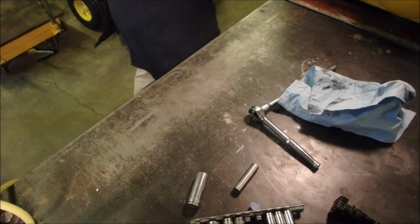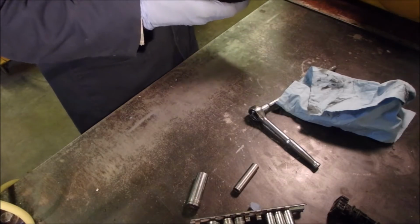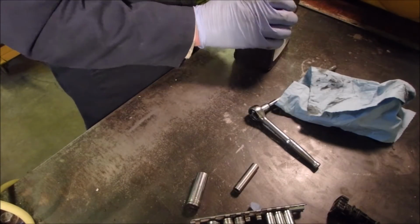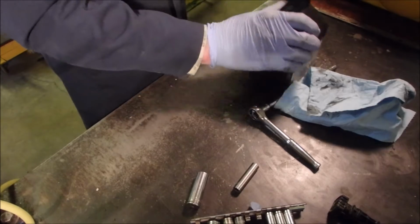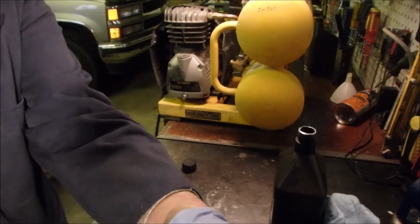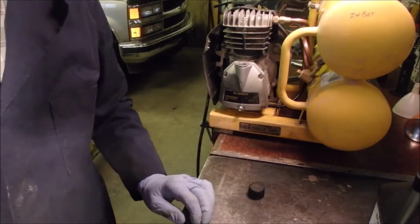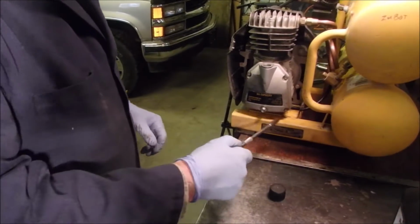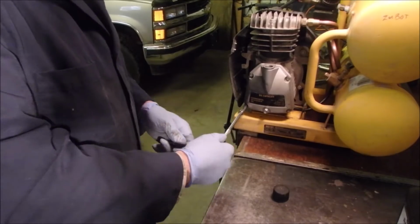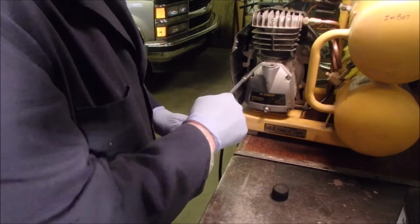And we got to get 6 ounces. Now here it says 40 weight. I don't have it, but I got 30 weight premium compressor oil. Oh man, I'm so sorry. Okay, now the cover's on. You guys missed that? I put it on with the 8 millimeter. I gotta look up when I'm on a mission. I forget about the camera.